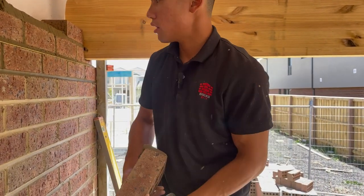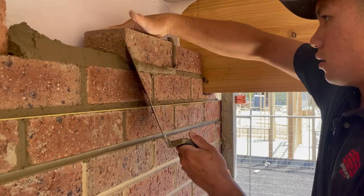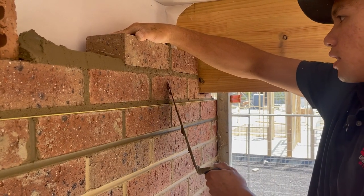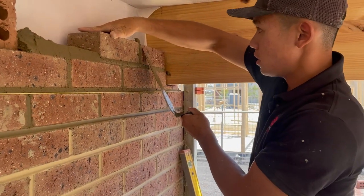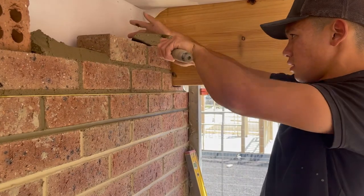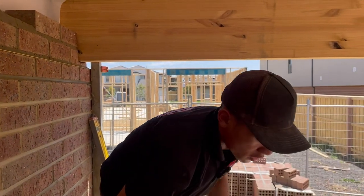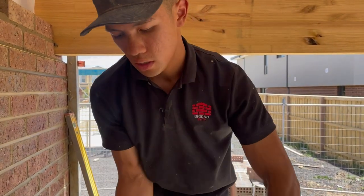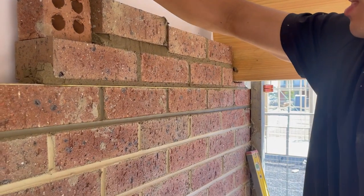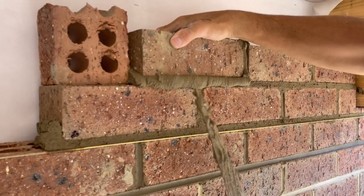Butter my next brick. Because I've got bottom edges to go off, and I've also now got a corner I can go off to. Butter my next brick. Remember, you always want to try to stay on bond. Always checking the bricks below. Remember, you've put this brick here as well to see the size of the perp that will be there when you place your full brick.